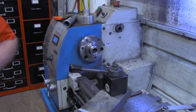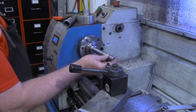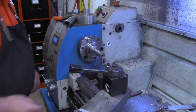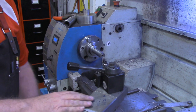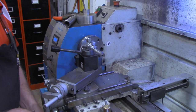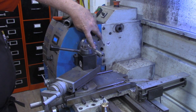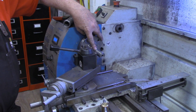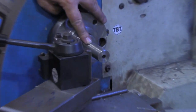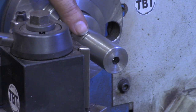Now, if I put our taper directly in that 5-to-3 adapter, I've got the compound turned around now to what the angle would be to cut the threads. I had a suspicion on this. The threads need to be 1 3/4, which is back here. Let me see if I can get you in a little tighter. Back here where this mark is.